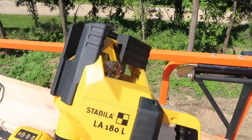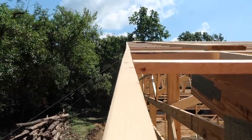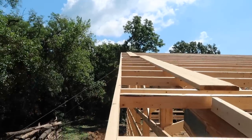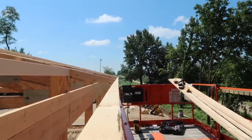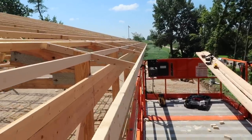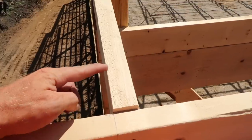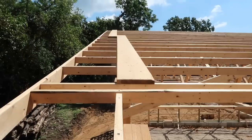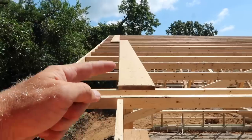While we haven't done any work to straighten these walls yet, you can see some ins and outs. These two-by-twelves have made a huge difference — it would be a lot worse without them. On our side walls you can see way down on the other end it bumps out a bit. What we're going to do is set that layout station right here — this line corresponds with the outside of our truss and runs up the line of two-by-twelve.